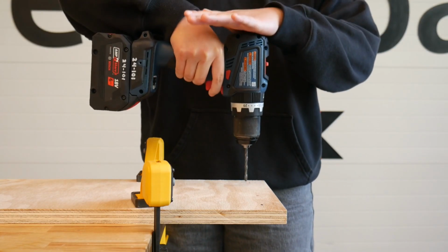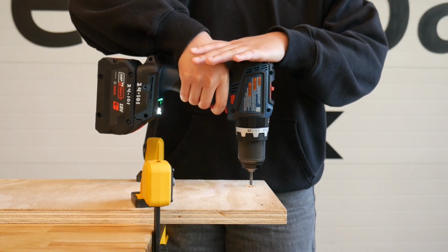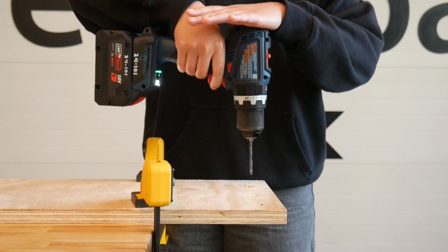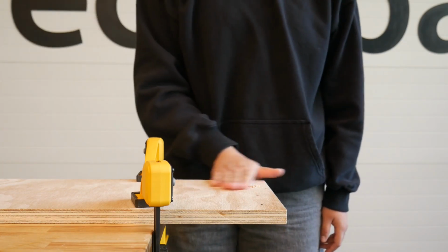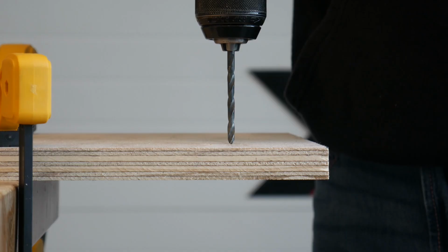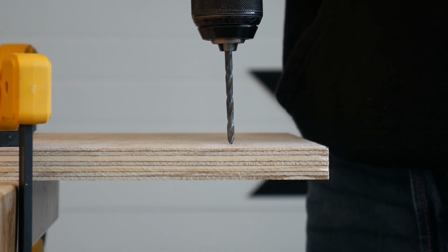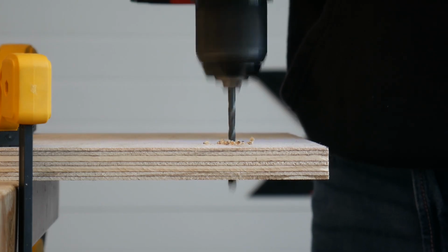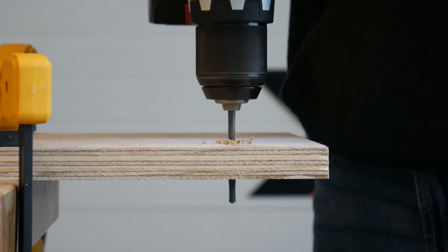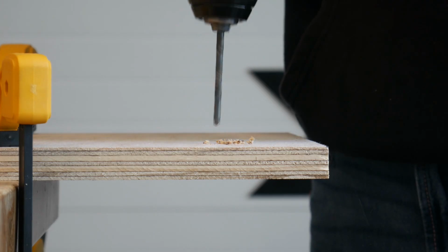With the proper orientation established, press the trigger. Apply force along the axis of the drill bit using the non-dominant hand. While drilling, the material will provide a feeling of resistance. However, after breaking through the material, the tool can easily progress too far, which would cause the chuck jaws to scratch the workpiece. Immediately after completing the hole, keep your finger on the trigger so the drill is still spinning as it backs out of the hole.